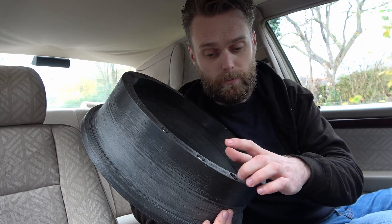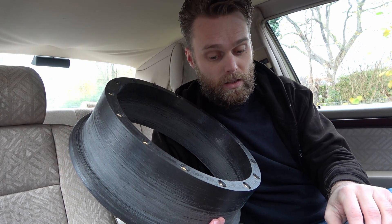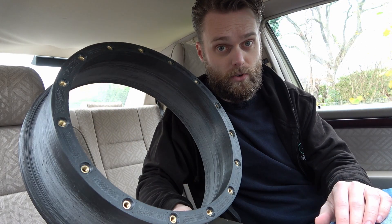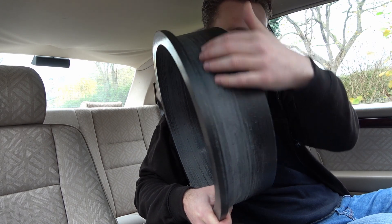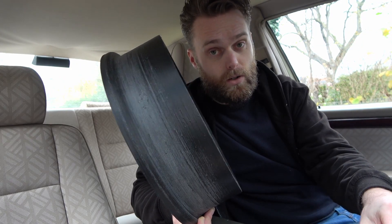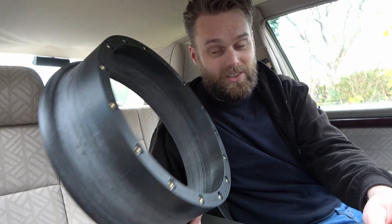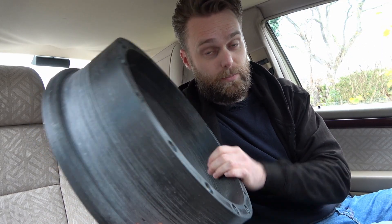The only thing I would do differently: I drilled out those holes, but next time I will just design it so the hole is as deep as the length of the insert itself, so you can push it all the way to the bottom and know it's flat. I've got some questions about why I'm using inserts and not just putting threaded rods all the way through. I explained that in the video, but this section over here is simply too narrow to put threaded rods all the way through. The only way to make this thicker is to increase the diameter of the rim, but my printer isn't big enough — this is the maximum size, I completely maxed out that printer.